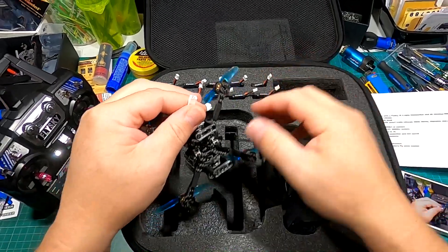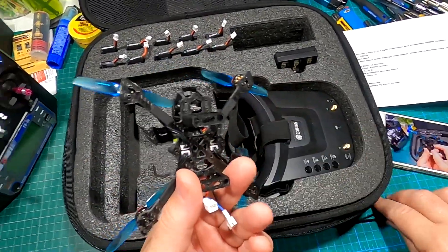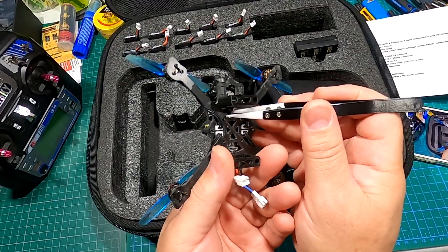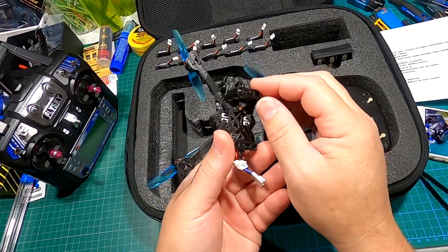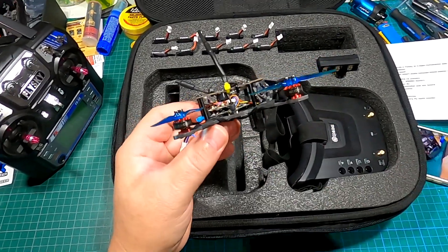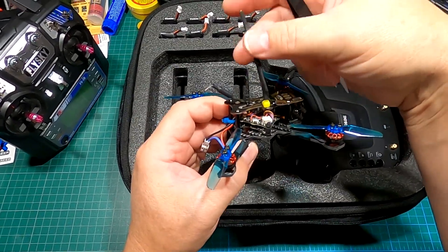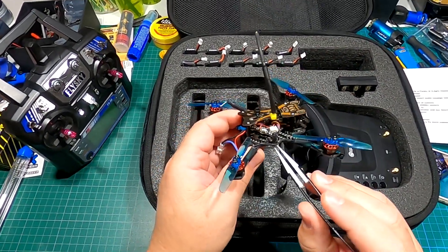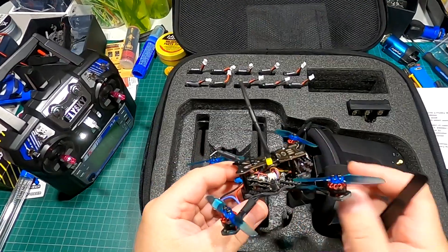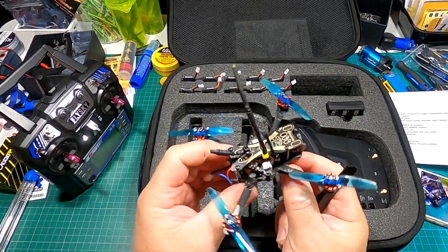It does come with the antenna facing out the bottom. You can see the original antenna for the onboard FlySky receiver, but I wanted some longer range so I added my own FlySky receiver, using a twist tie and heat shrink tubing to put the antenna up. I soldered it in — positive, negative, and the signal wire to a free UART port. I'll show that in another video.